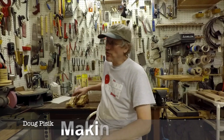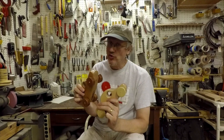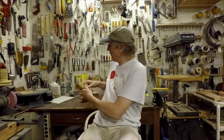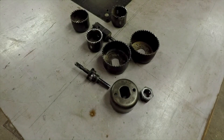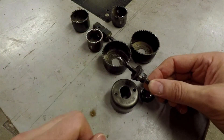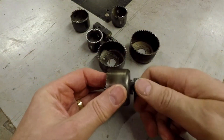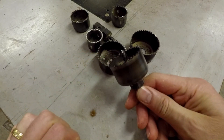If you're getting ready to make some wooden toys like these cars, the wheels can be great and a lot of people sell some really sharp ones. But if you want to make your own — especially if you've got a lot of scrap wood around — let me show you how. It's real easy. For example, these which I made out of plywood as well as these in case you want different sizes. To make holes I'll use hole saws, which come in all sorts of sizes. Many come with a central quarter-inch bit — that's perfect for making the central axle hole and fits on just about any size hole saw. Once you've got this, you're ready to go.